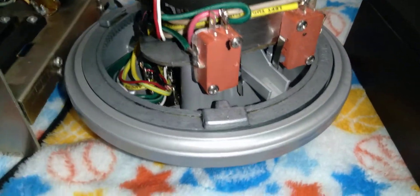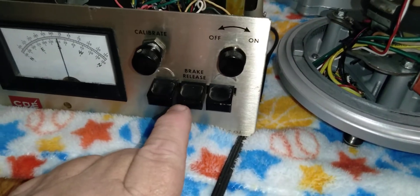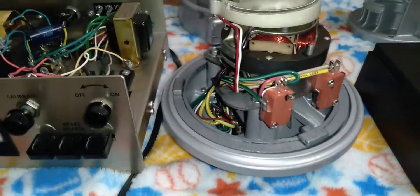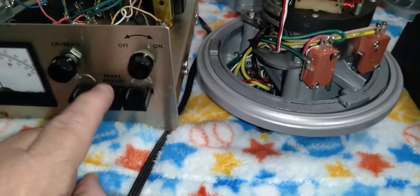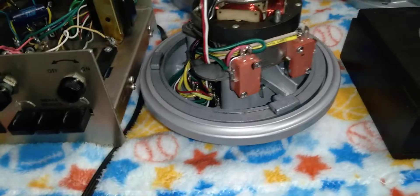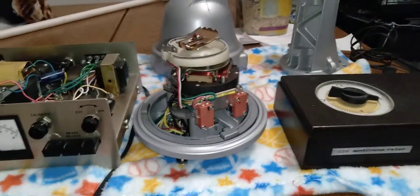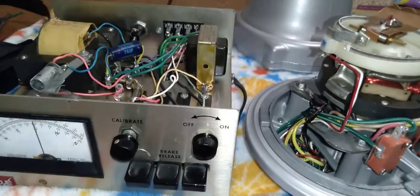There's a lot of mods to these. One of them is a brake delay where you could take your finger off and the motor would still be turning just by the mass of the antenna — the big beam would still be turning. What would happen is you take your finger off and the brake blade would go out and it would start making noises up there and tear up your rotor. But basically, that's it on the mod.